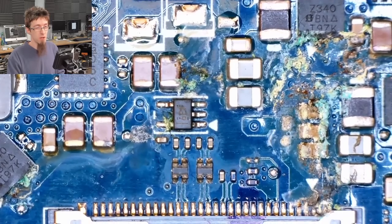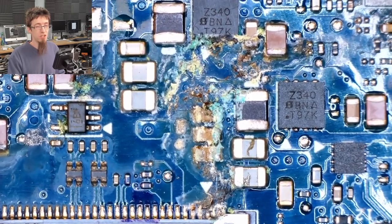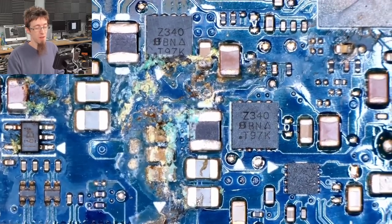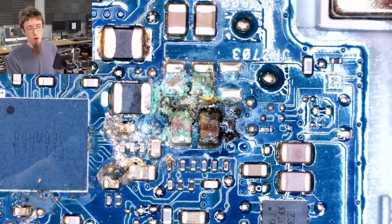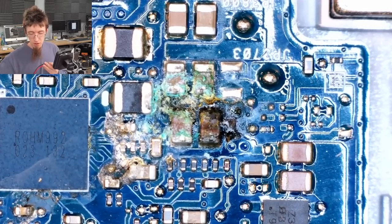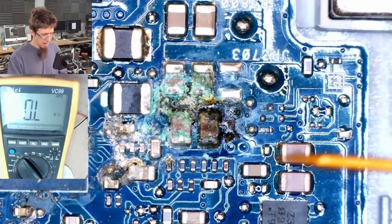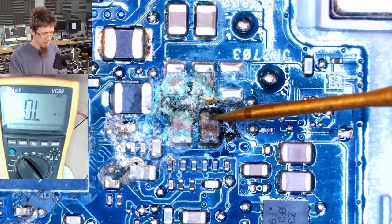But on the flip side, I'm looking at this amount of work and going like, oh man, just surely it's worth cleaning all of that off first and then seeing where we stand. Let's see. Firstly, let's just see what screamingly obvious short circuits we have. I will put the multimeter into resistance mode and put one probe on ground, and let's just start having a look around here.